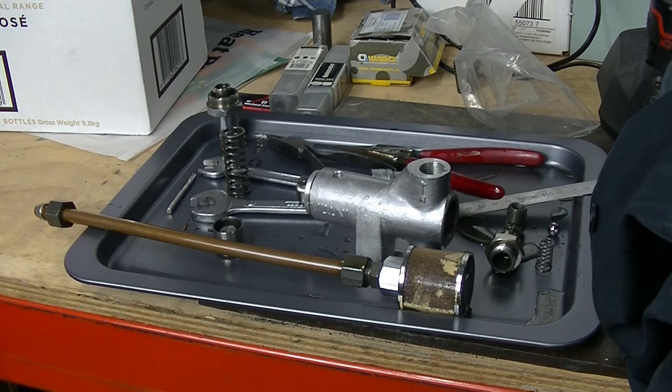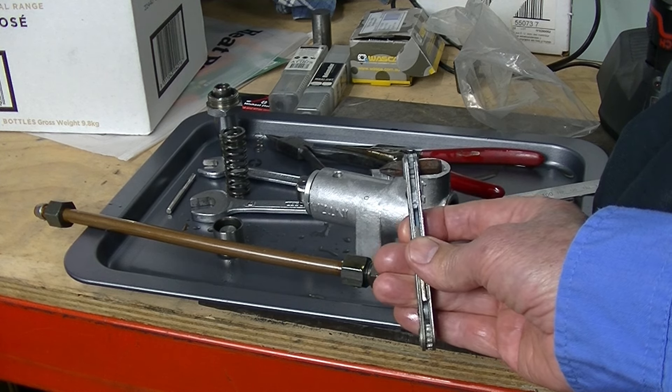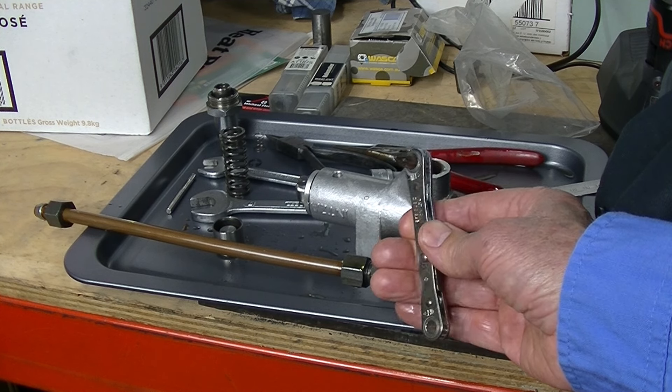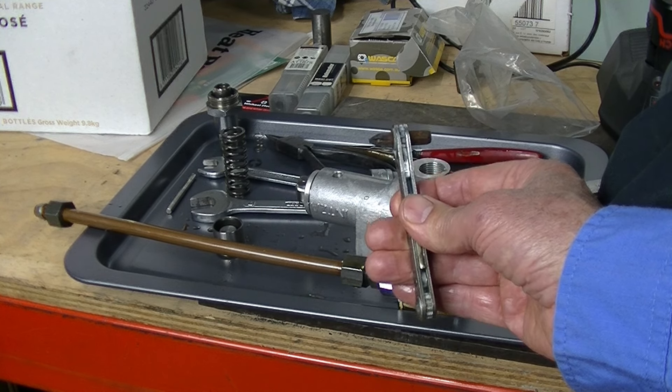Here's a little hint for you. The main screws that hold this pump into the body of the shaper are 8mm hex socket head cap screws, and they're difficult to get to in behind the main drive pulley. I did make up a shortened Allen key for the job last time and that's been lost. But just by chance I've got an old impact screwdriver set sitting on the shelf, and the five-sixteenth AF hex shank fits right inside the 8mm socket head cap screws onto my ratchet ring spanner. So that made the job - instead of a half-hour nightmare - quite easy to do. So a little hint for the future: find your old impact screwdriver sets.